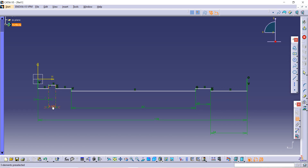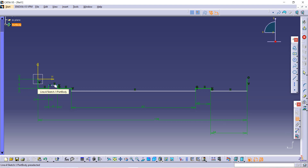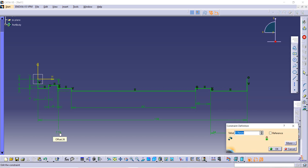From this to this is given as 6, and the remaining line will take its dimension automatically. Now for the radial dimensions: this external line to the central axis is given as 12 divided by 2, that is 6. Then this line is given as 8 divided by 2, that is 4. This external line to the central axis is given as 18 divided by 2, that is 9.